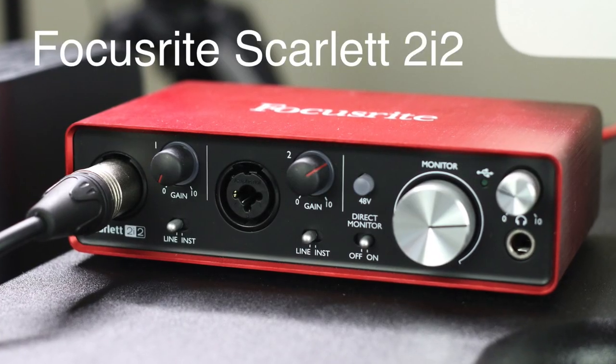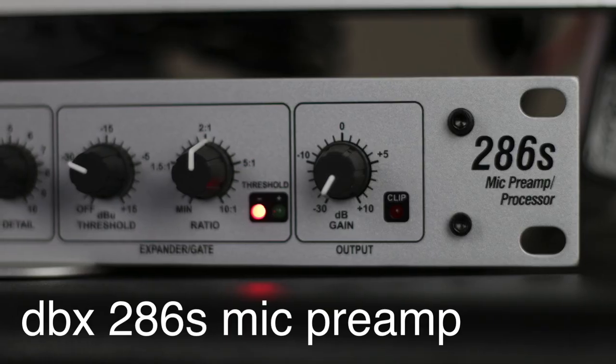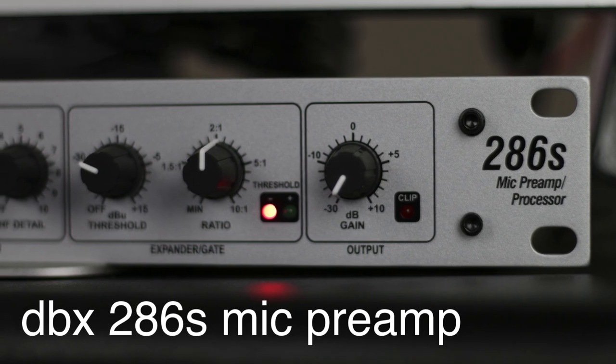The Podcaster is a USB microphone. This one is XLR, so you will need an XLR cable and an audio interface. I'm also processing the sound before it hits the computer. Do you need all three - XLR microphone, audio interface, and preamp? You don't. You can use just a USB microphone. The Audio-Technica ATR2100 is perfect for that. If you want XLR, you will need the audio interface to convert the signal into something you can plug into the USB of your computer.